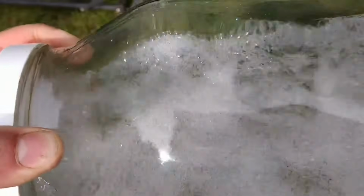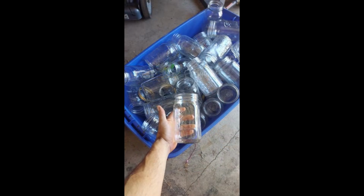As the temperature approaches your target temperature and getting close, I'd say around 175, you just want to start looking for the drip from your condenser or from your worm. And then when you see the first drip or two, you want to turn your coil on, or turn your pump on if you're using a condenser, so that you make sure you're condensing that steam back down.